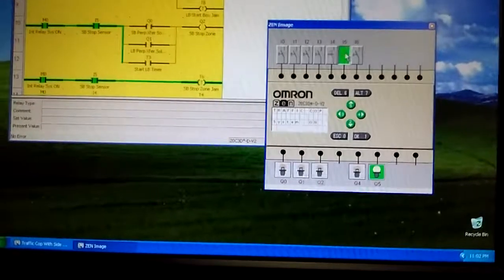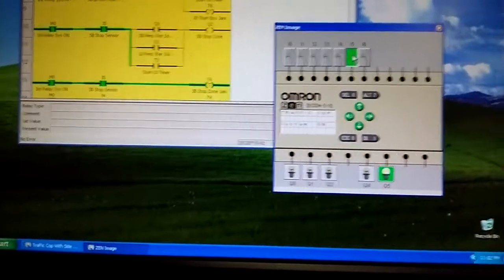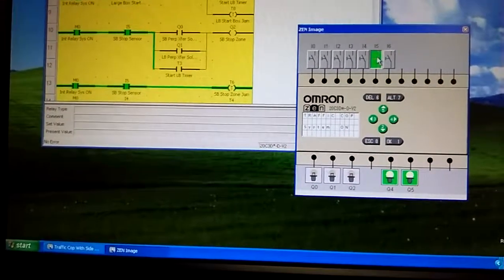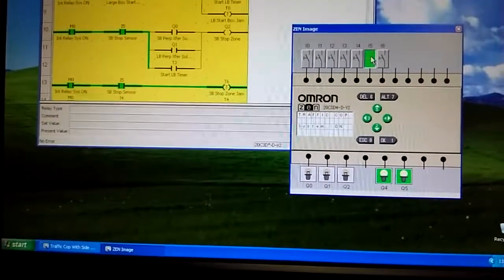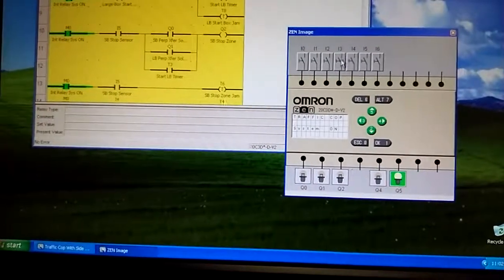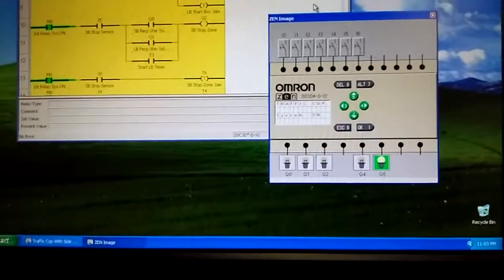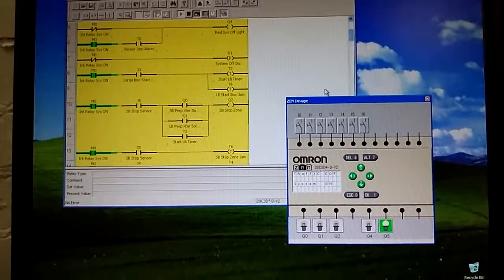That's the safety system - it senses a box jam and flashes the warning light. It will not stop any of the conveyors since it's not hooked up to the motor contactors, which helps the motors last longer by not cycling on and off. After 30 seconds, the red light flashes. Once the blocking box is cleared from whichever sensor, the red light automatically turns off - no reset switch needed. Next up is a video showing this uploaded onto the computer outside in the shop and working.